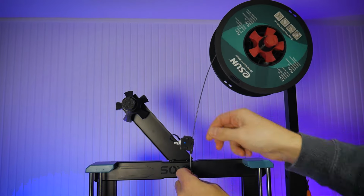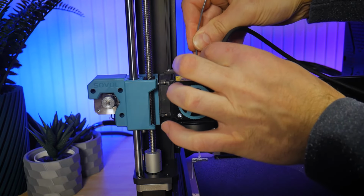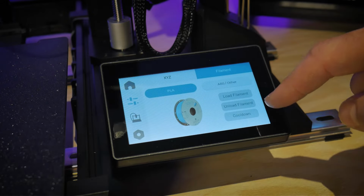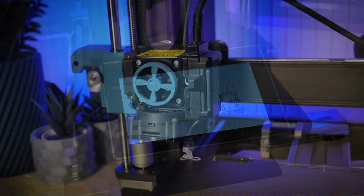And I've named it universal because if you guys have watched a bunch of my other videos, you'll see that I've used it on a wide range of printers at this point. The height can be adjusted to accommodate taller or shorter printers, and the SV06 doesn't require any special brackets or adapters because the filament runout detection sensor is already located at the top of the printer. So it makes this a very simple install.